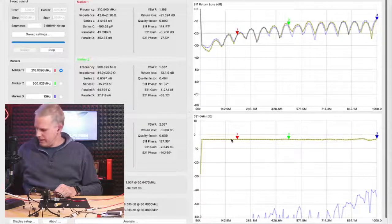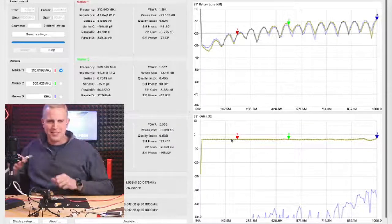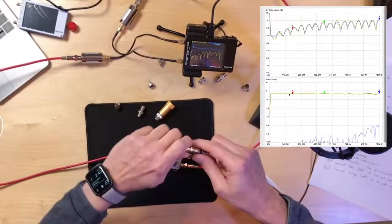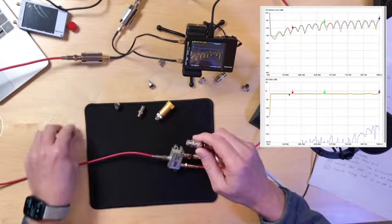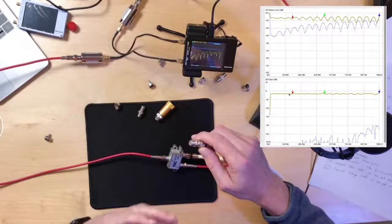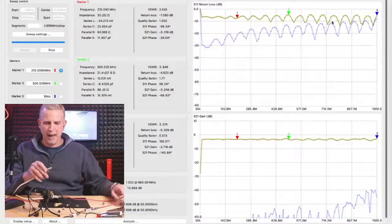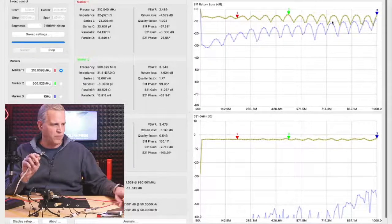Yes. Now, what's going to happen is that this subscriber decides they don't want the set-top box anymore, so they're going to disconnect the set-top box and send it back to the cable operator. And now look what happens. Our return loss gets really bad, because we have an unterminated cable.